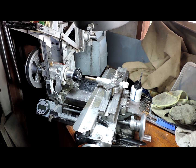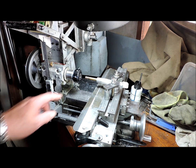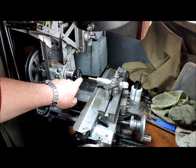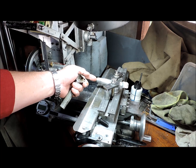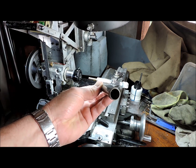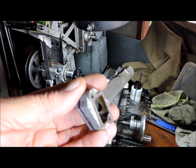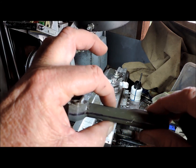I've got the manifold mounted on the milling machine. I'm now going to bore out the manifold track — that was the 10mm drill I used in the lathe. I've put it back in to line up with the collet to get that at the right position, and now I'm going to step over and make the intake track oval shaped. This end is 14.5mm, but it's a slot at that end, and that is because this necks down here.